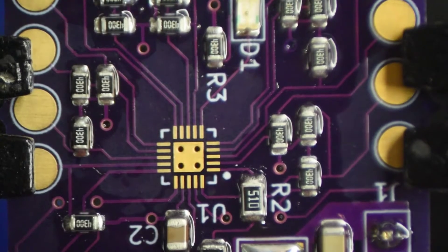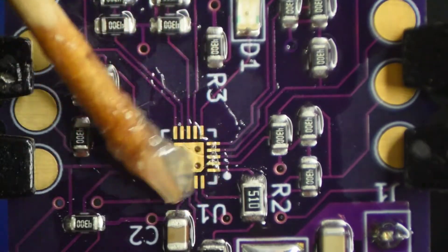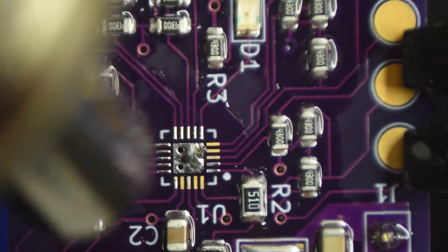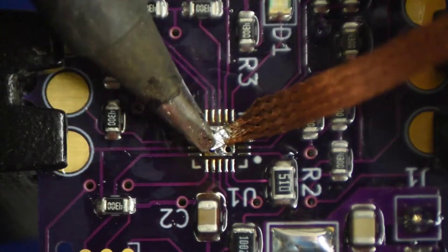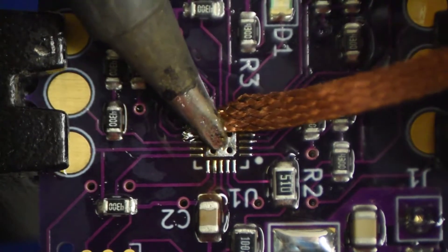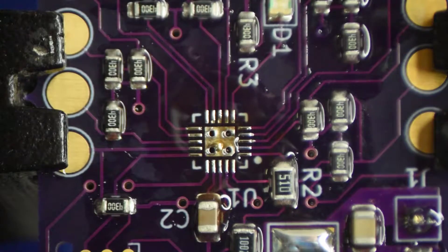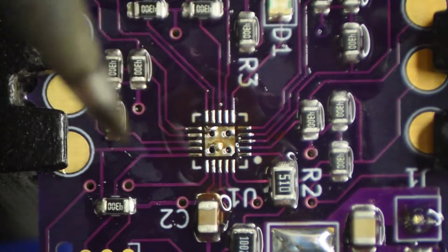Now this board is ready for a QFN test run. A thin layer of flux. I started putting solder on and realized I hadn't heated the board up, so I put a bit of hot air on it. Of course, I get way too much solder on the thermal pad. At least now I know when it's too much, so I solder wick it off, but then basically have to start over on the pads. I have the soldering iron set to 510 degrees so it doesn't boil away the flux. At the lower iron temp, a bit of work can get a nice mound of solder on the tiny pads. If I'd quit hitting the thermal pad, it would make things a lot easier.